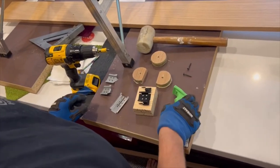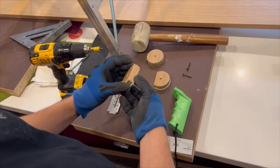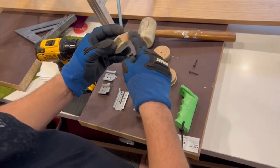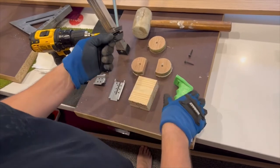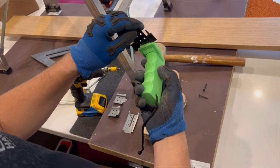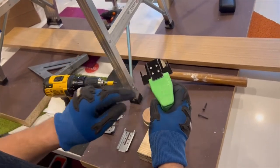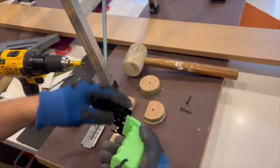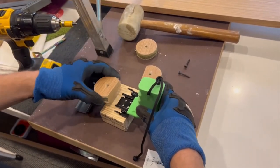I've got a little demonstration here of how all this works. When you use the bayonet clips, all you're really doing is penetrating the veneer on the side. To load up your bayonet holder, you put it in with the two clips on either side going into the slot — that leaves the back part against your mounting surface. Imagine this is the plank that's already mounted on the wall.